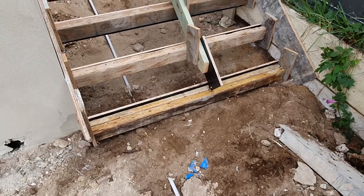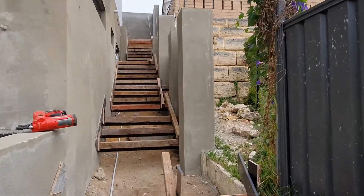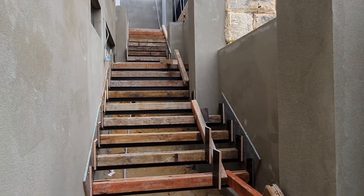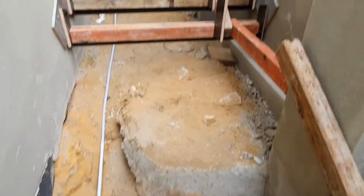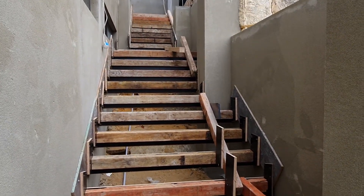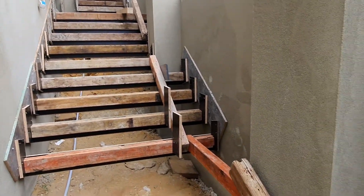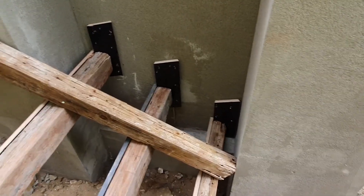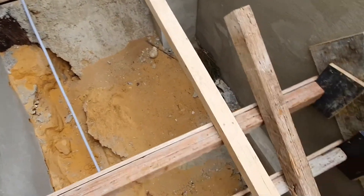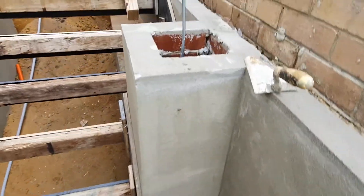These stairs are complete. They're only lightly braced. All these risers are 1450 wide, and with the timbers I'm using and a 160mm rise, they won't bow — it's right at the point where they just start to bow. So I've just braced the wide ones, but I haven't over-braced it. They don't really need it — stepped around piers, just a little brace between, just to keep them, just for a bit of extra support.